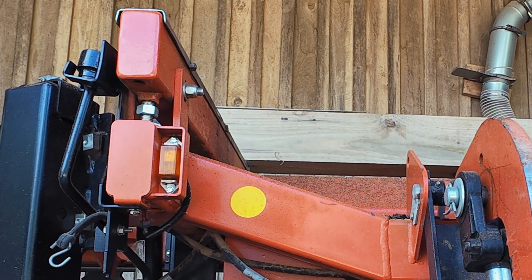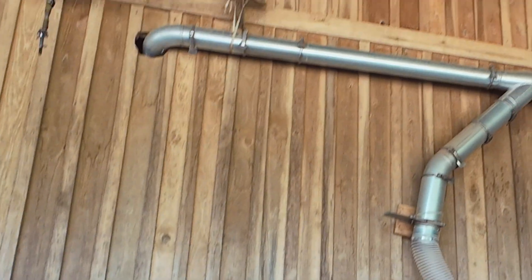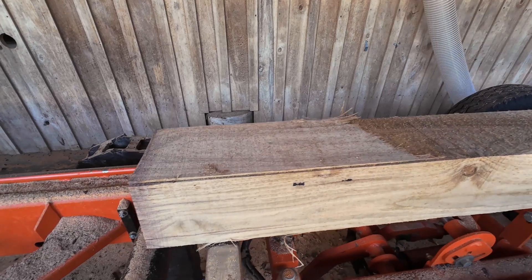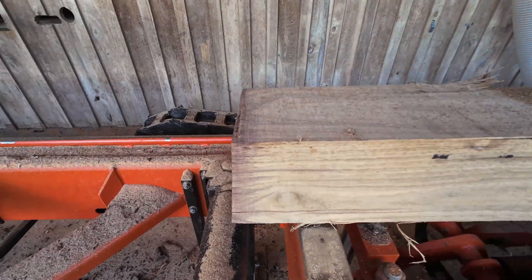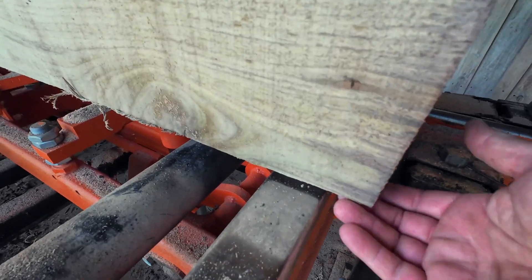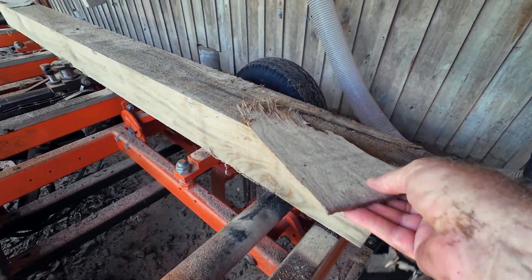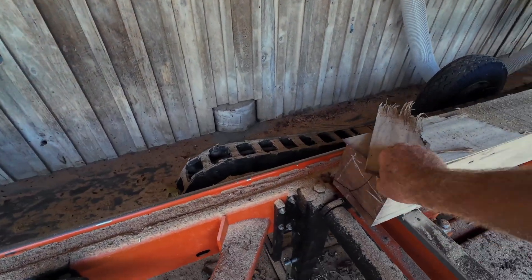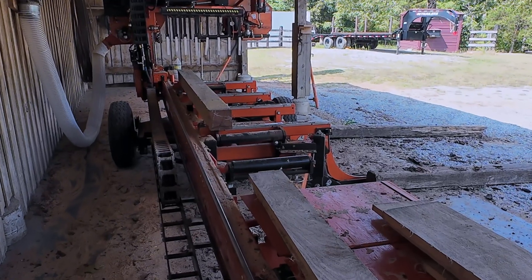Now, remember me telling you how much stress this cant has on it — you want to put your dog board down. Look how much this thing's coming up. When I did my dress pass, because I know it's coming up, look how much I took off of there. Look at that one down there — look how high this one's up off the deck. Since I did a skim cut on this top surface, I'm not that worried about the dog board. All the nastiness should end up in the dog board.